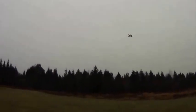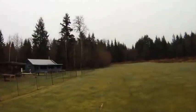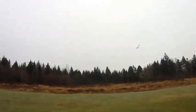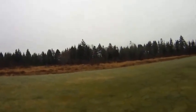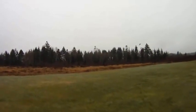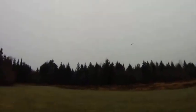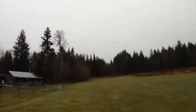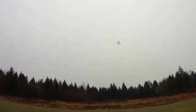So I think maybe just a bit better acceleration, just, you know, in the initial maybe 5 to 10 feet after hitting full throttle. On the bench, this prop actually tested with some better thrust overall. I think I was around 27.5 ounces, which I think gives me around a 1.5 to 1 thrust to weight ratio. So not bad in the vertical.